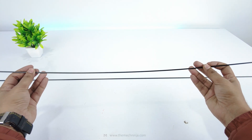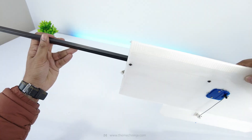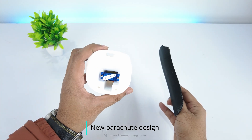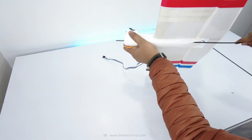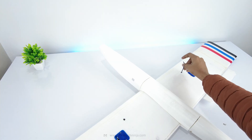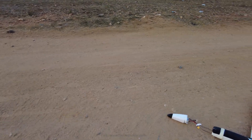For the redesign, I used two 3mm carbon fiber rods for fuselage support, reduced wall thickness to 0.4mm, 5% infill, and printed at 60mm per second. The wingspan was expanded by 20cm, making the total 1.4 meters. The new parachute uses elastic force and deploys using a servo. Every part was weighed carefully to calculate the CG. The Pixhawk was replaced with a lighter F7 Ardupilot controller. I began testing with a single racing motor and a 6-inch prop.